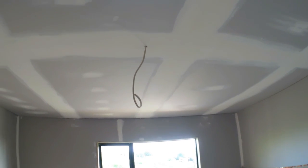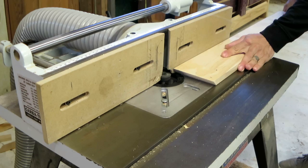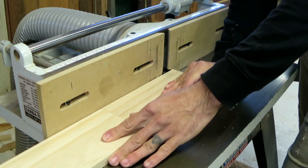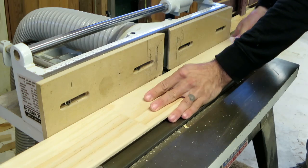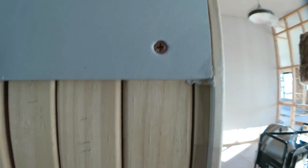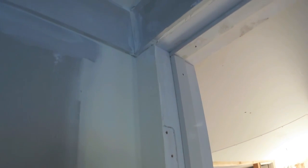I came up with a unique system for the internal doors of the house. We're going to rebate the door jambs which would usually have architraves on them, and then butt the plasterboard right up into that rebate and glue the plasterboard in against the jamb. Then it gets plastered over and it just becomes a nice neat hole in the wall — clean cut, there's just a door stop for the door to sit against. Now, is it going to crack? Well, probably, but I'm guessing very minor because the plasterboard is actually glued to the jamb, so we'll see how it goes. Dad's opted to run his doors right up to the bottom of the scotia, so that's a whole different kind of look as well.